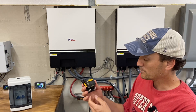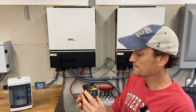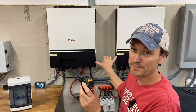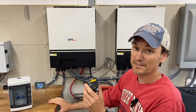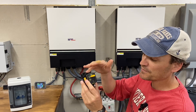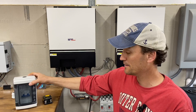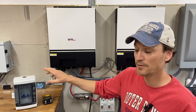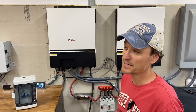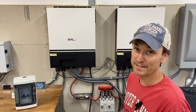This is a Blue Sea breaker from Amazon, and they're actually quality breakers, but it is 48 volt max DC — and you need well above that for a 48 volt system. The nominal voltage of lithium iron phosphate, which is the batteries I'm using here, is 51 volts. 'Nominal' is just a fancy word for approximate, but you need above 48 volts for your breakers because 48V is the max on these. So for a 24 volt or 12 volt system these breakers are actually quality and really good, but above that you're going to need a larger breaker. It doesn't have to be from Watts 24/7 or Signature Solar — there are links below — but a lot of people are paying attention to the amperage and getting 48 volt or below on Amazon, not paying attention to the voltage.